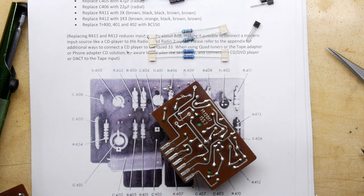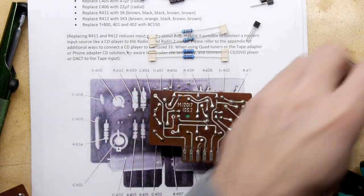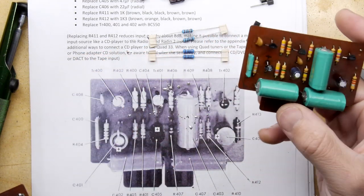And something I'm going to do before I power this on, I'm going to go through this board with a magnifying glass and make sure there's no solder spatter. Because you don't have that solder resist, it would be very easy to get a bridge. So